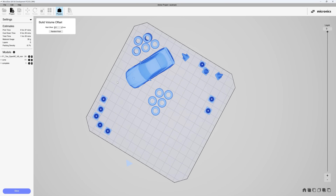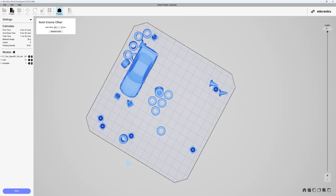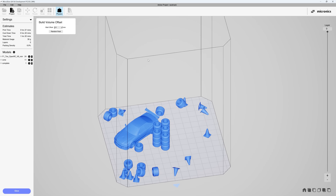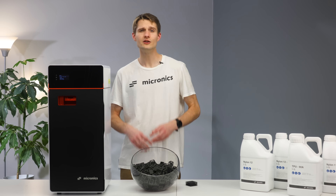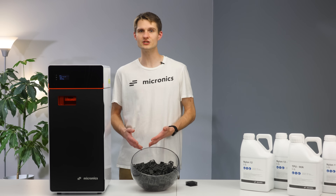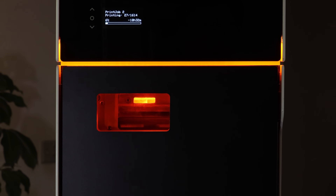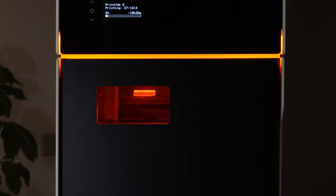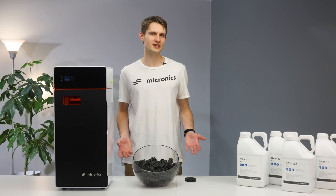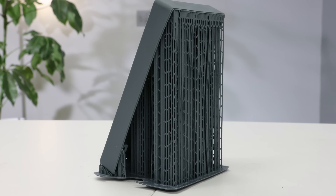And with position locking, feel free to build out your favorite race track and do donuts around it. Another great thing about SLS is its reliability. The beauty of SLS is that the print process is mostly agnostic to the part geometry — powder is laid down uniformly and gets fused by the laser in the exact same way no matter what you are printing. There are also no build plate adhesion issues or support structures that can fail.